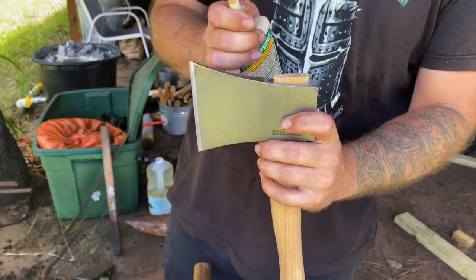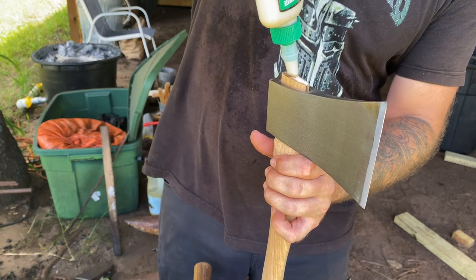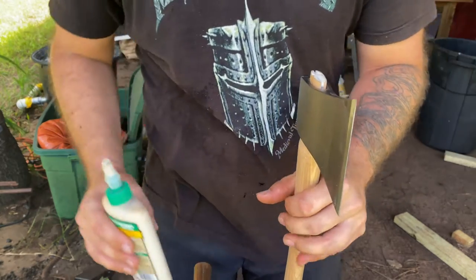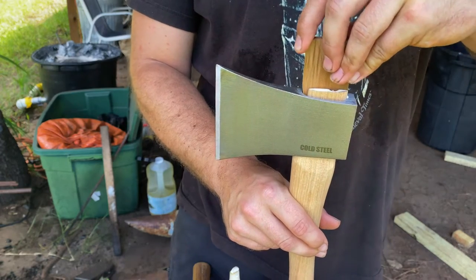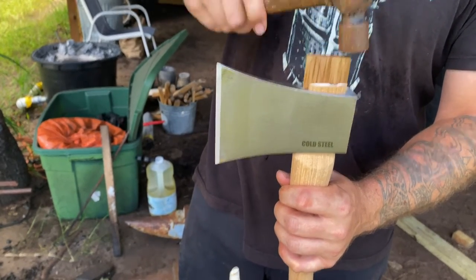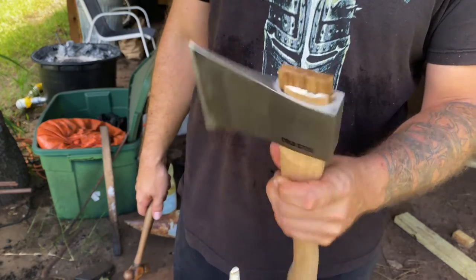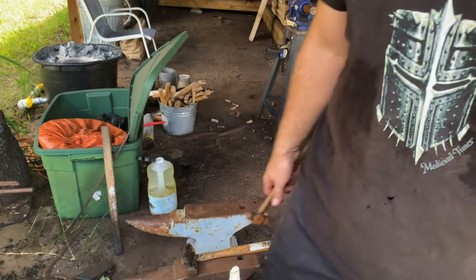Got some wood glue. I don't just go squeezing it in there all willy-nilly, but use enough. The majority of what holds the handle onto the axe is just friction — nothing wrong with having a little extra assurance that it ain't going to move. Then just tap that in. Eventually it stops going. Now we sit there, we wait for the glue to cure. Then I come back, slice all that off. It's a couple of hours later and the glue has had time to cure.